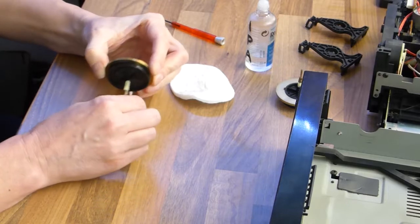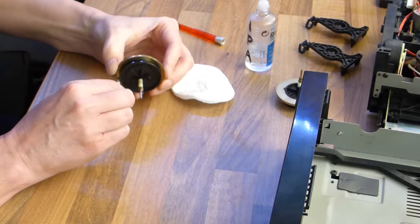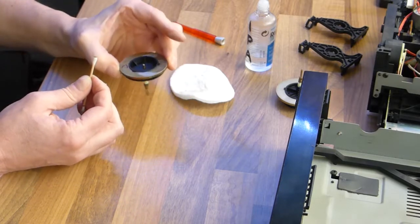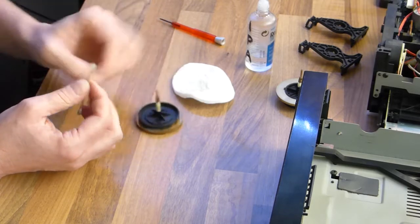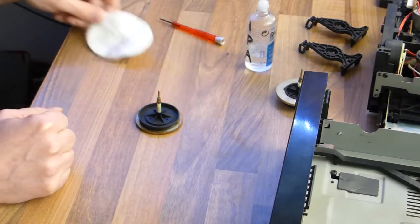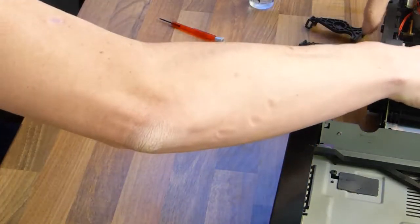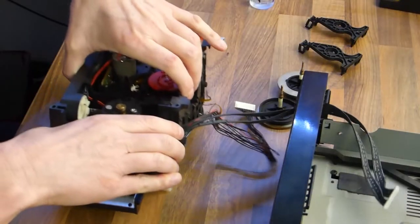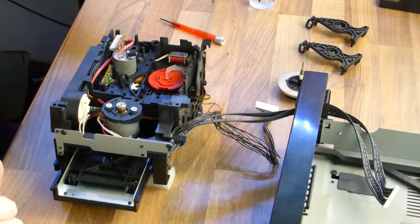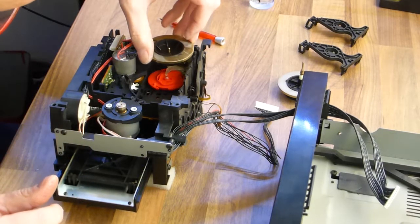So just to elaborate on the analog cassettes, yes, the heads are very, very good. They are not the normal type heads. They are MR heads, magneto-resistive heads. I'm not sure if I say it correctly, but anyway, the technique is very good, and it gives very good response for analog tapes. But because the tape in analog cassettes is a totally different kind from DCC, probably your head will get dirty very, very quick.